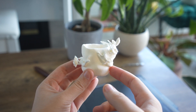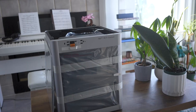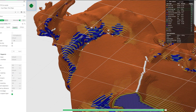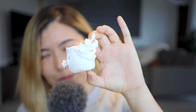As a first test print, I was extremely satisfied with the quality. I was really happy to discover that the extruding parts that were kind of half hanging in the air stayed on really well, and the PLA material felt sturdy. The real challenge, as I discovered, was the overhangs. Overhangs are the underside of your slopes, where each layer sticks out more than a certain angle from the previous layer. All of the supports are generated for these areas so they don't hang in mid-air and gravity won't pull them down. For the tiny test print, I decided to stay on the safer side and generated a ton of supports — it kind of worked out, but the supports were really, really hard to remove.